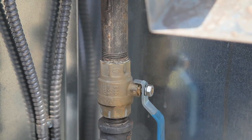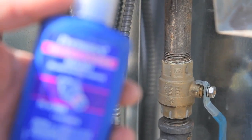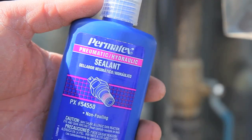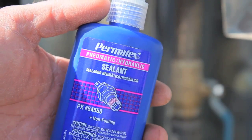Fitting together threaded steel pipe connections was a part of my boiler installation, and I originally used Teflon tape and ordinary pipe compound to seal those threads. Unfortunately, a number of those connections leaked, and that means I had to take everything apart and start all over again in some places. I ended up switching to an automotive thread sealing product, and it worked really well. It was fast and perfectly effective. Now, this little bottle costs $40, but I'll tell you, it's well worth it. Don't skimp when it comes to sealing any pipe thread connections in your installation.